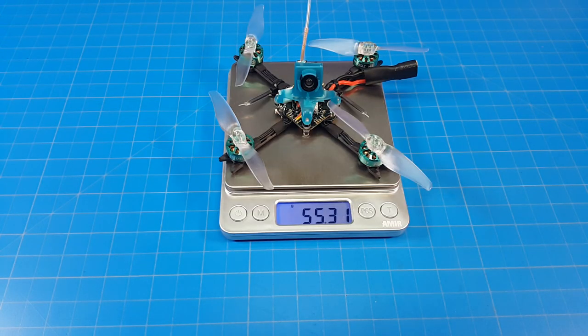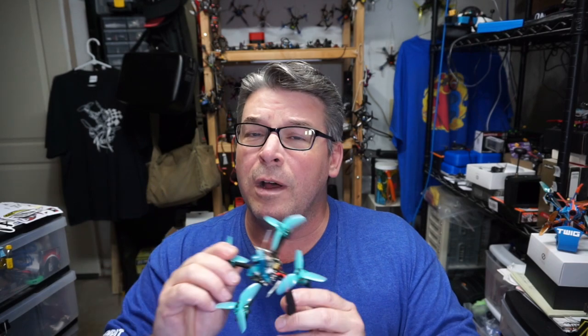Let's get the scale out and see what it weighs. The Splinter as built comes in at 55.3 grams — pretty dang light. I'll tinker with both 2S and 3S batteries and I think I'll get under the 100-gram mark, which would be nice for something this size. Hopefully you found this video at least somewhat informative or entertaining. Coming up in phase two will be the tuning and flight. I probably won't step through the tuning process in detail because it varies widely between Betaflight 3.5 and 4.x — Bardwell released a video suggesting 4.1 is very good for micros so I may give that a whirl. Please leave any comments, questions, or suggestions below. Thanks for watching.